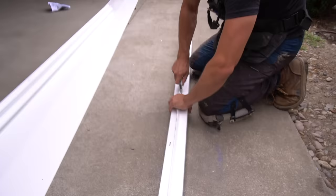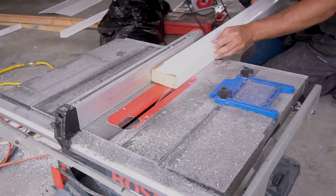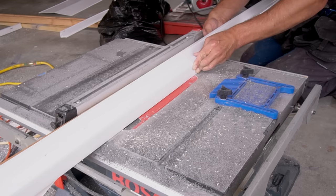With this deck having a beautiful divider board system, we have doubled-up joists, and doubled-up joists actually affect the installation of our dry space because we need to make doubled-up combo brackets. TimberTech does make doubled-up combo brackets so you don't have to do this step, but I didn't know that ahead of time and therefore had to make my own.